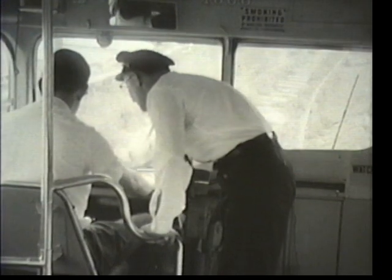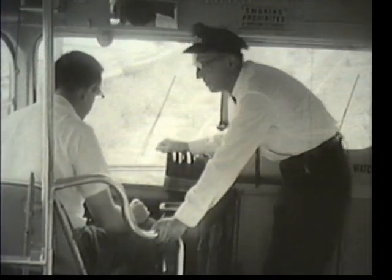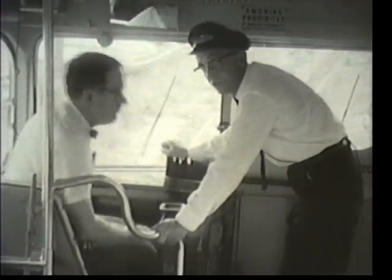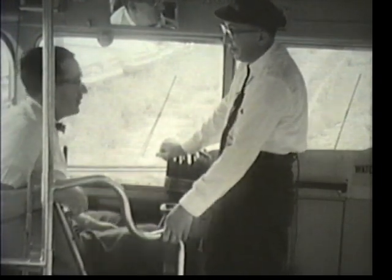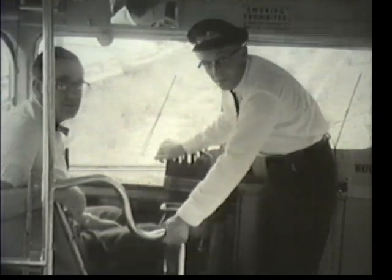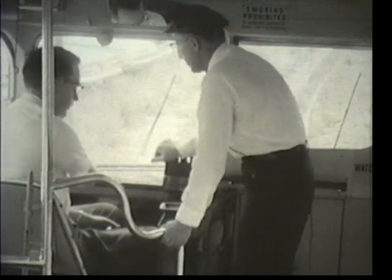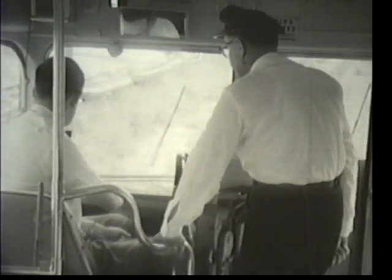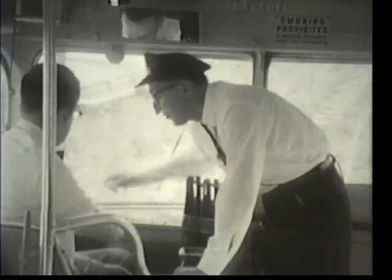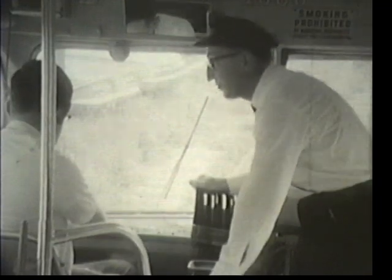Pull this — that's your center door, push that up. The center doors have opened. We always like to have you make an announcement when you open the center doors: 'Please watch the center doors.' Make sure nobody is standing in the door well. It's very possible to have injuries, that's why we like operators to make that announcement. And if you want to open the front door, same thing — push the button. Never leave your hand on the buttons after you open the door, because sometimes you may have a defective switch and the door may close. You may get somebody caught in the doors.